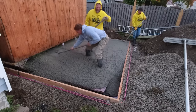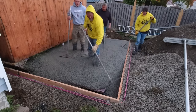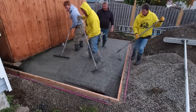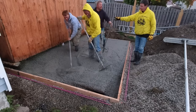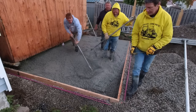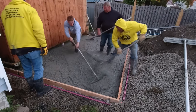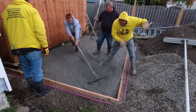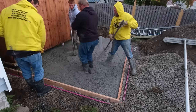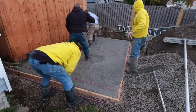The contractor actually did all the prep work here — he dug everything out, jacked the garage up, set the forms for the slab, and put the styrofoam down. We came in, put the wire down, and we're going to wet-set the rebar around the edges. It's about a six-inch slab; the edges are about twelve inches thick. This is a pretty typical monolithic slab here in Maine. The styrofoam is code — it just helps keep the frost from getting down under the slab.